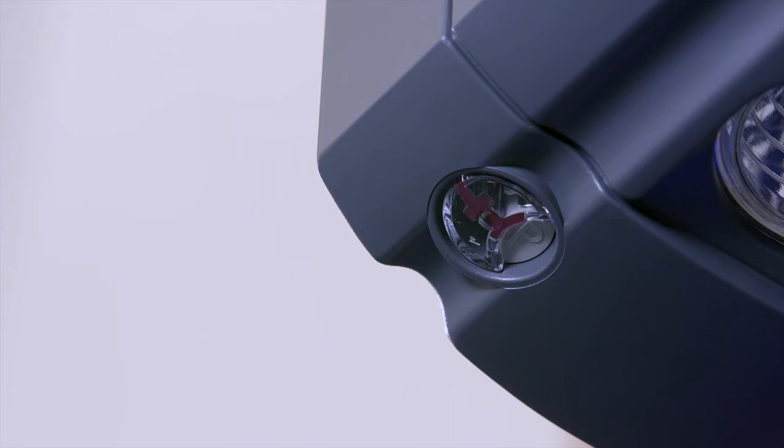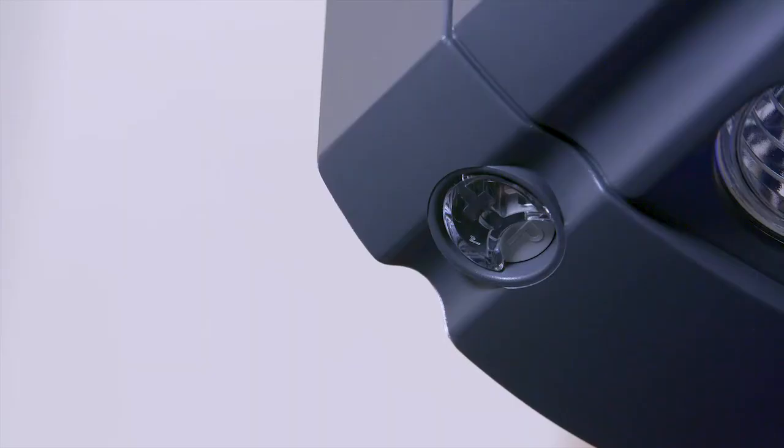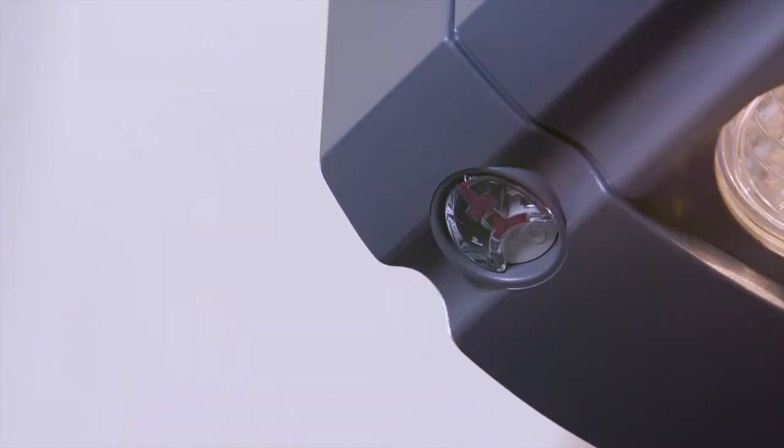Should the door hit an obstruction or have any operational issues during travel, this is typically shown as an error message through the clear button on the underside of the motor case. This would typically be a 3 or a 5 flash sequence on the red LED. Should that be the case, check that the door is fully functioning and that there's no visible issues. If you're comfortable that there is no operational issues with the door, press and release the T button and then operate the door as normal to see if that's resolved the issue.